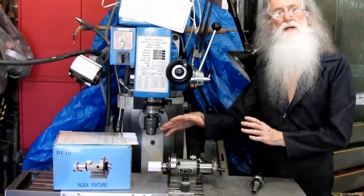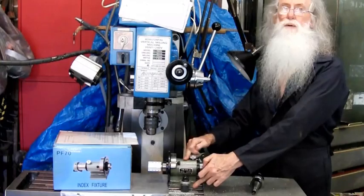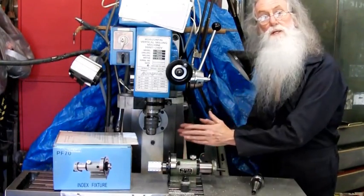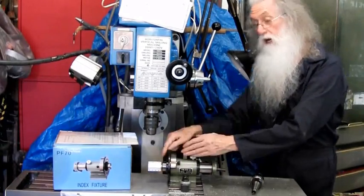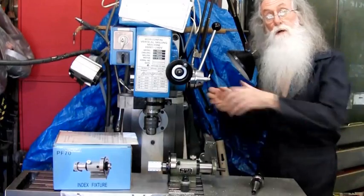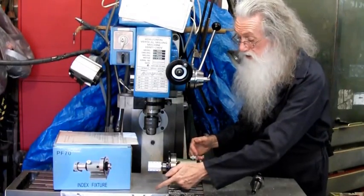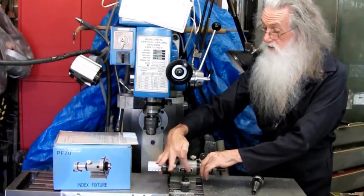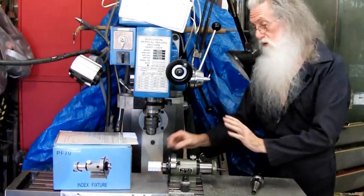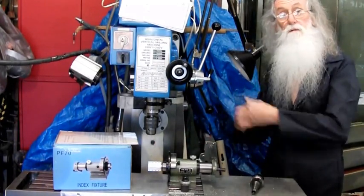Then if you have a chuck set up on your mill and have that zeroed and you know that's 32.786542 millimeters or whatever, you know that you just have to move this across and you're on the center line. So you can take it out with your chuck still on, put it back in, no problem. You can also set the chuck, or the vise can just touch on there and that can be the zero of your vise, and then at the jaw you can measure that and get those distances. So it's very easy to pull off and pull back on.